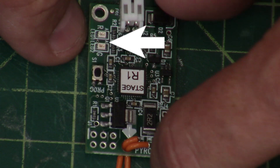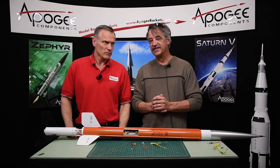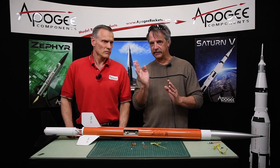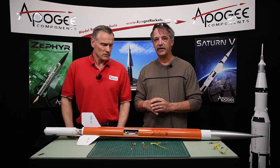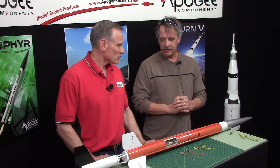You can set the time using the user interface - there's a red and a green LED and a little program button. You can set the time anywhere from 0.7 seconds all the way up to 99.9 seconds. To get an accurate setting, use a metronome or a large clock with a sweep second hand to get within a tenth of a second. To set it, just push the button down and hold it for as long as you want, and when you release it remembers that time and uses it when it detects a launch to start your upper stage.